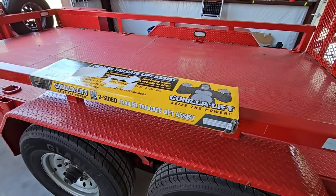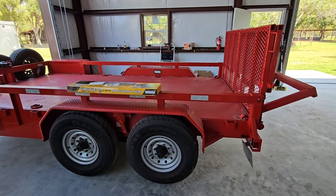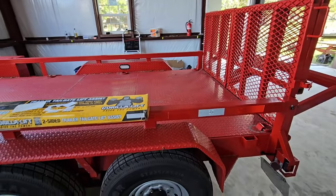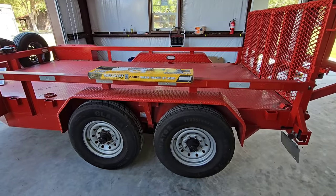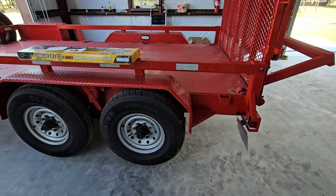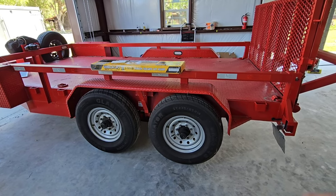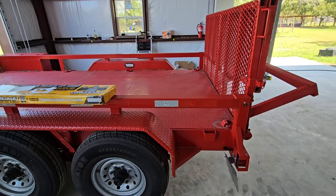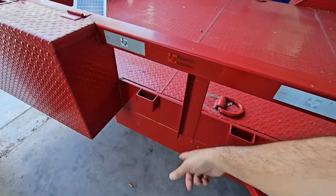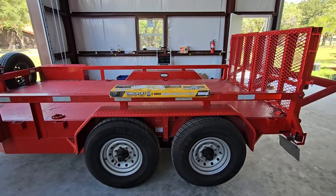What's going on guys? Today's video is going to be pretty interesting. In front of us, you're looking at the 14-foot Texas Pride Lowboy trailer. This thing was overbuilt for us — insanely overbuilt — because even the Lowboy deck probably sits about 4 inches taller than most of them. Mainly because we're running 8,000 pound axles, H-rated tires, we have no dovetail on the back, and this thing is built on two 8-inch C-channel frames stacked. This thing is one absolutely heavy-duty beast.